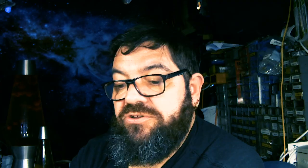If you have any questions leave a comment. If you've got any other suggestions of what you can do with an old power supply, let me know. It's a nice little add-on — just make it nice and easy. Who needs to drill holes and put knobs? If you want to charge something on USB or need a cheap, quick 12 volt supply at 15 amps, then your old computer power supply is the answer. We're still in the process of building the new workshop, and when that's finished we'll be moving everything in and you'll see more vintage radio restorations and other larger projects.